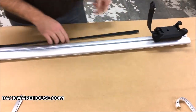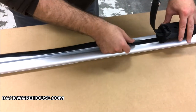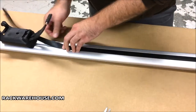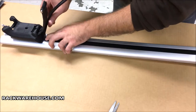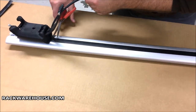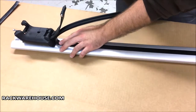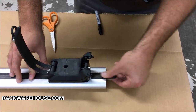With the towers now properly set, take them off the rails and reinsert the rubber strip. Push the strip into the slot from one end to the other. When you reach the other end, measure out the proper amount and cut off the excess. With the extra strip, fill in the outside part of the bar up to the semi-circle cutout in the bar.